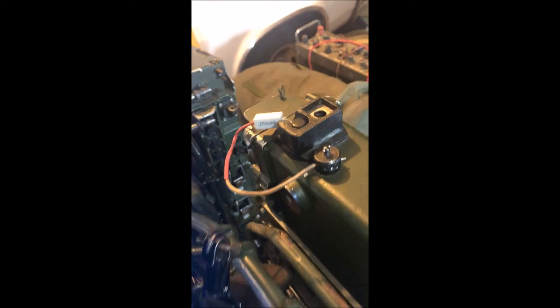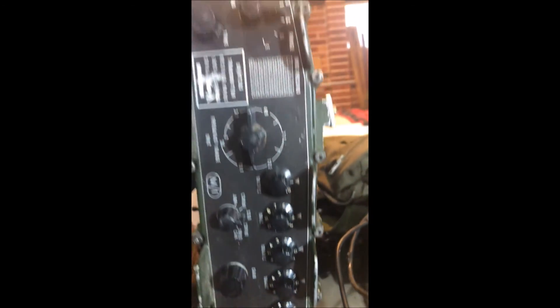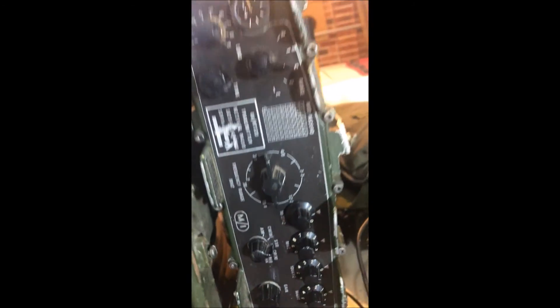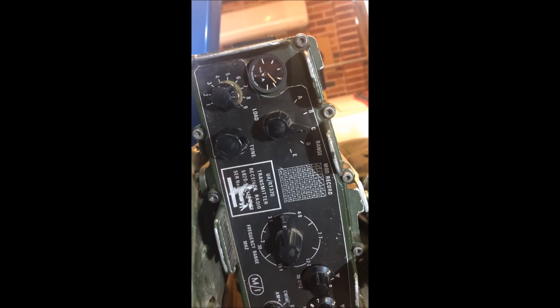Cleaned up. Put it back together and reinstalled back on the set. Still using our 470 ohm little test rig there. We'll have a look. And by the way, all this test is done on 14 MHz — I've had all the dials set on 14 MHz. So let's have a look and see if we fixed it. Ah, satisfaction — isn't that fantastic?